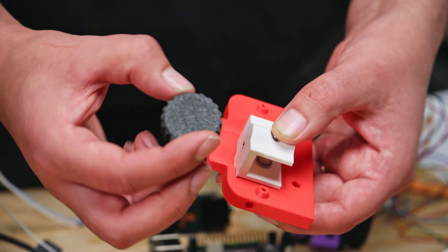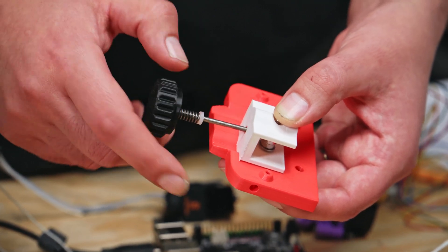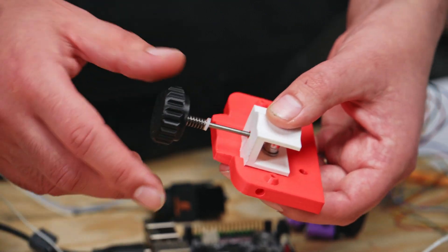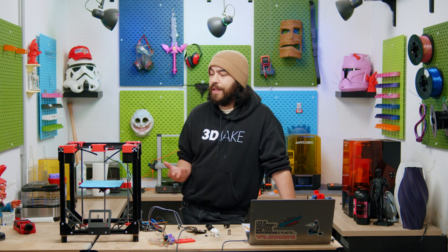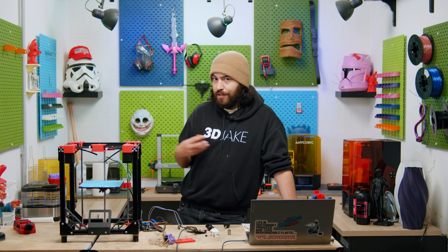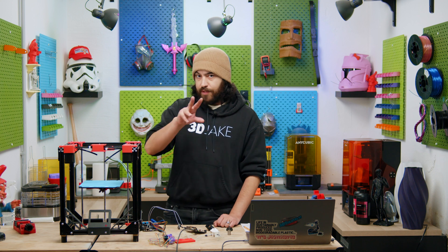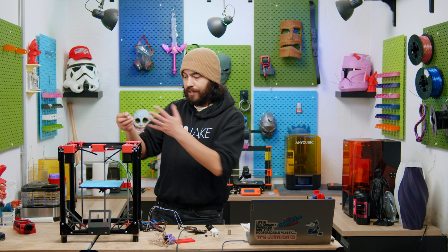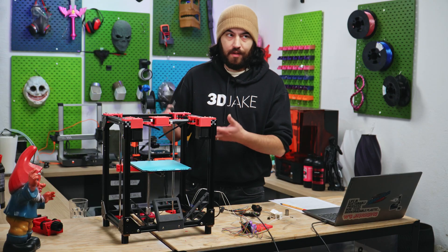The design you see right here is not the intended finished design - it's actually just a cutaway version. It is basically sliding contacts which house our flange bearings, attached with a screw that can move them back and forth as you turn it, tensioning each belt as you wish. A big problem I have right now is the bulkiness of some of these parts - most of them are larger than what they need to be, and if I keep the current scale I will actually be losing build space because there's just not enough room for the printhead to move around; it's colliding with things. So a lot of these need to be redesigned and miniaturized. With the tensioner I'm thinking of reversing it entirely so that the thumb screws can go on the very back, giving more space in the chamber. I'm also thinking of losing the springs and using TPU standoffs instead.